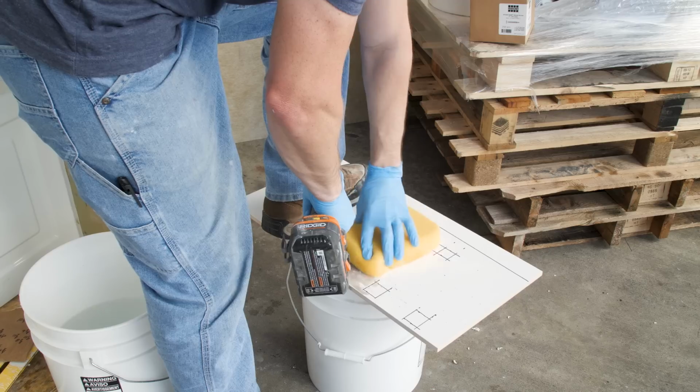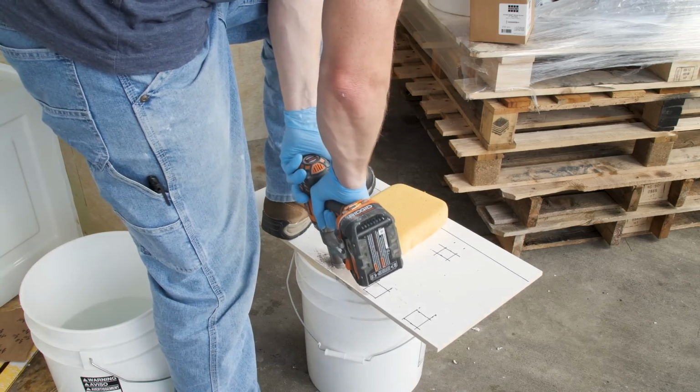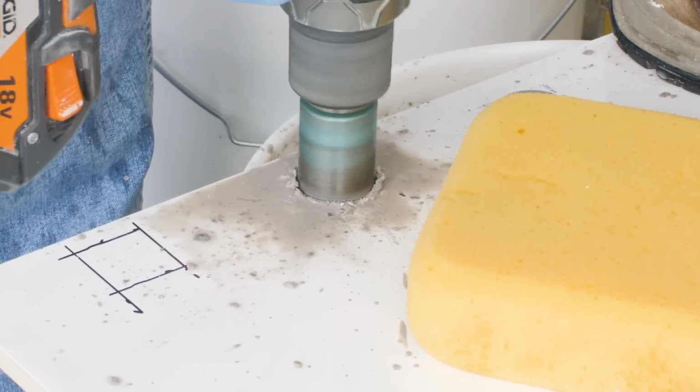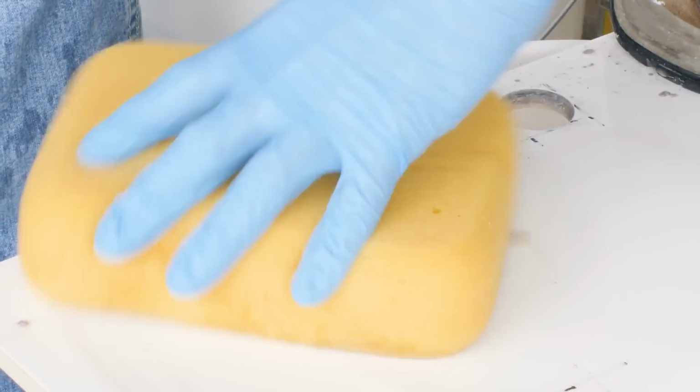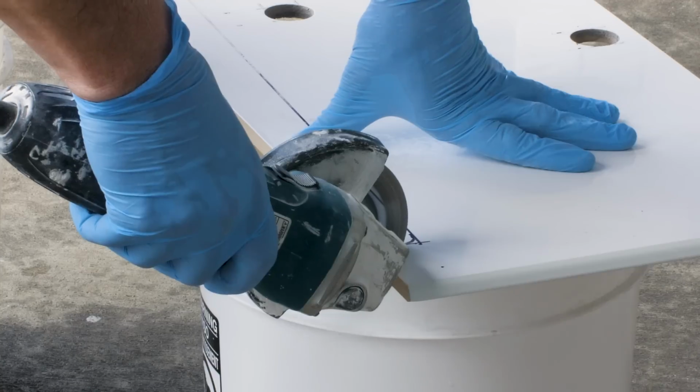Using a cordless screw gun, begin with the core bit at a slight angle. As the bit begins to bite, you can begin to trace the outline of the circle you're going to make and orientate the bit 90 degrees. Periodically add water to the bit to keep it cool and clean out the debris.